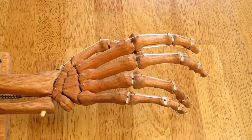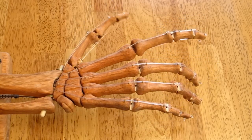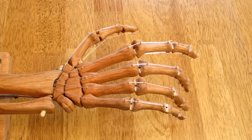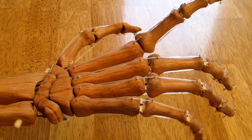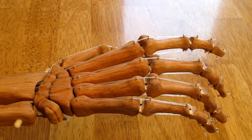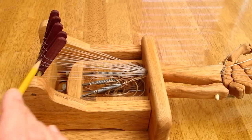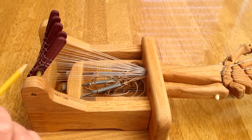There's also a control for raising and lowering the wrist. The 30 pull cords and the 5 tension cords come through the hollow bone, out the other side, and end up at these controllers. Each controller has got 6 holes in it — 3 for the top pull cords of the finger and 3 for the bottom.